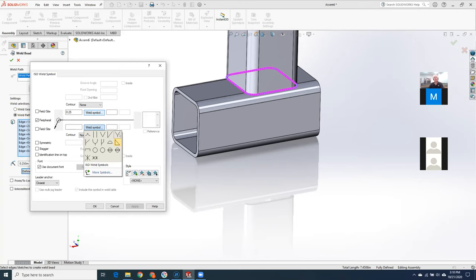Here are all your different types of welds. And if you guys go to Pratt & Whitney at some point, you can get into all of these crazy things. So fillet weld, this is your common MIG weld. Seam weld means just butt the two edges together, go right down the middle. Let's see, seam centered. The little X, this is spot weld. This is common with automotive stuff. But again, for this class, just go with a good old common fillet weld. And we will say okay.